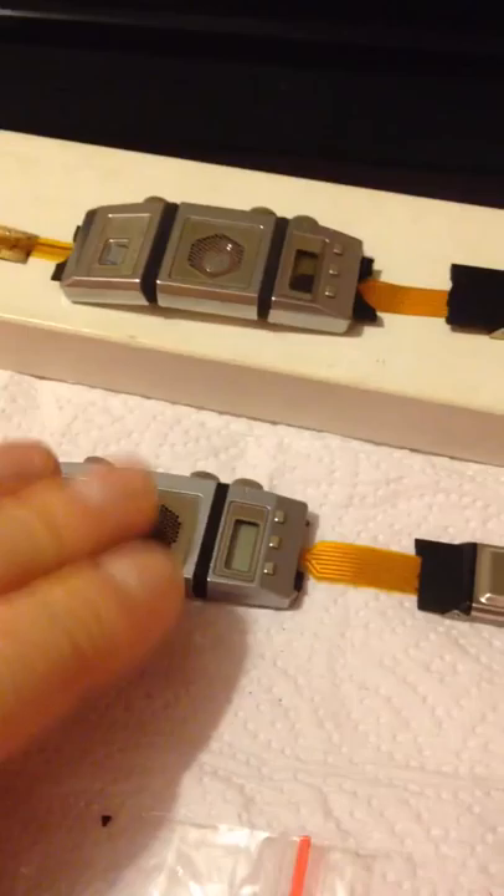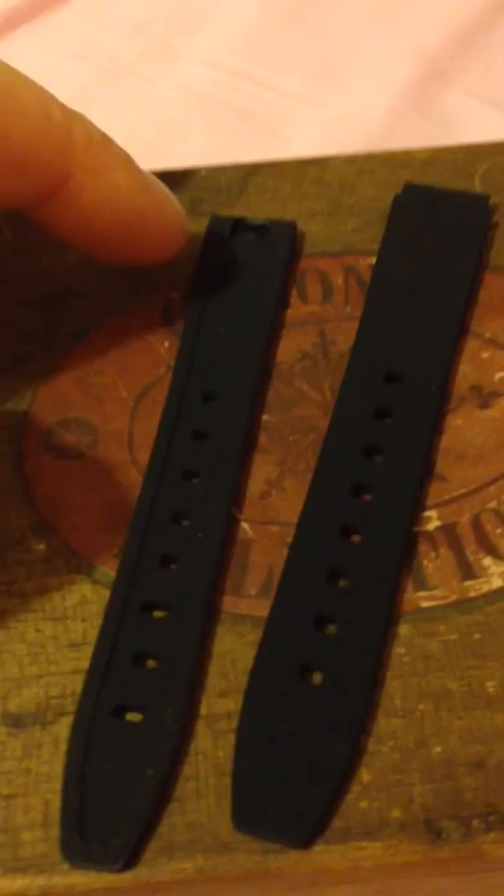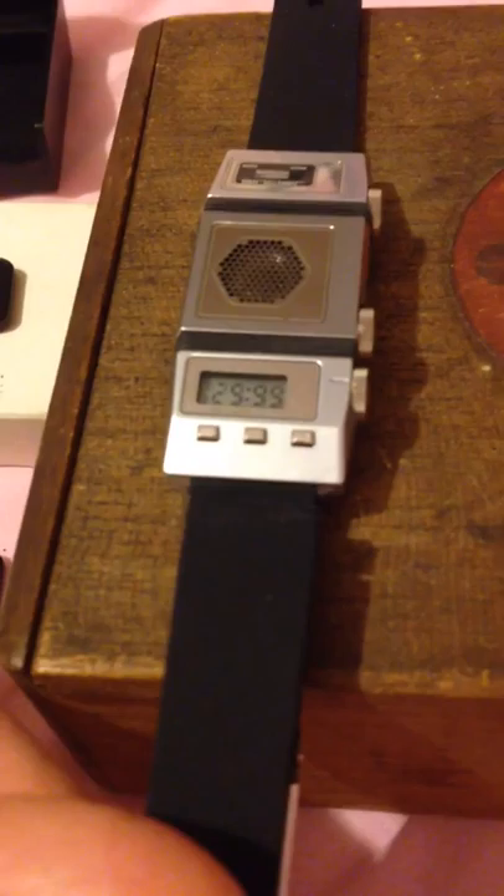This one here I've basically had for ages. It came in exactly the same state as these. What I've done is spent ages trying to locate the right type of straps — obviously you can't go and buy a strap for it. It has to have a channel in it, the right sort of length, and obviously the right width. So this is a 16mm and this is an 18mm. 18mm is a bit big, hence I've got the little cut-outs at the end. Just use a really sharp scalpel knife. You also have to cut out areas of the plastic so that the clasp area can fit on it, because normally the strap would be a little bit thinner.